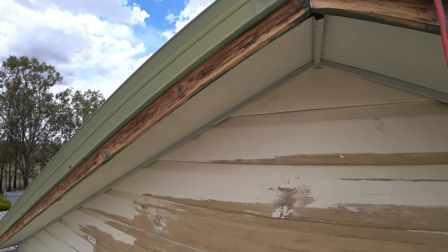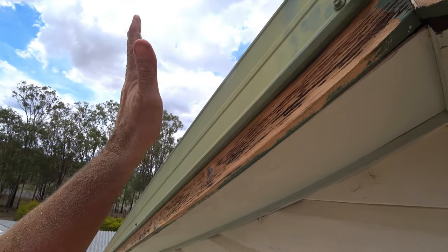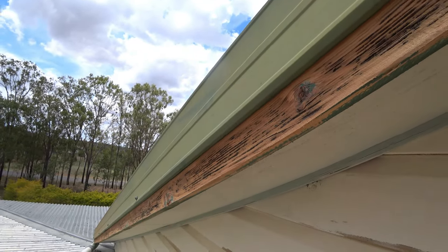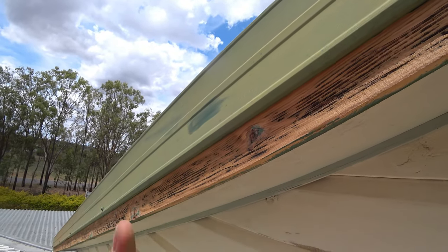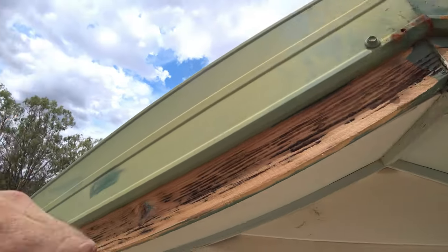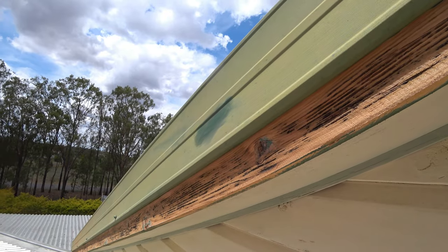The owner's given me permission to choose the colours. We're going to go colonial — just the green up there as normal. All this is going to be hosed down — not just hosed down, but wiped off. You see this powder? You cannot paint over that. And you can't just gurney it off either — that won't help. You actually need a rag and a hose to wash that back to the surface to make the paint stick.